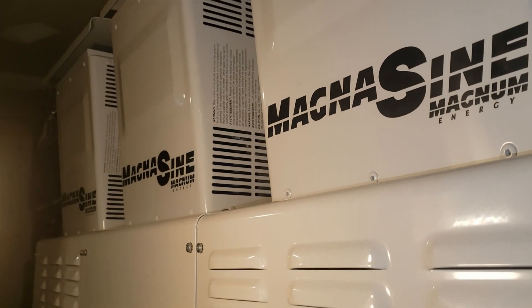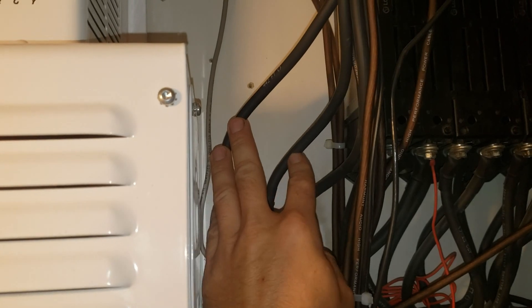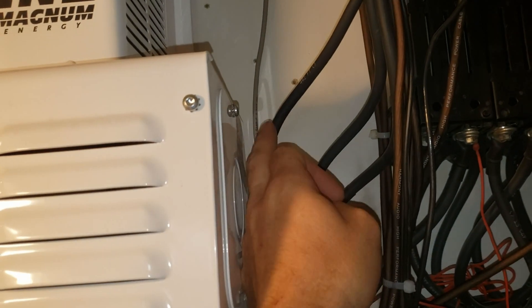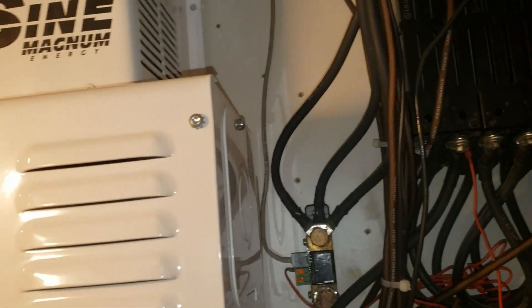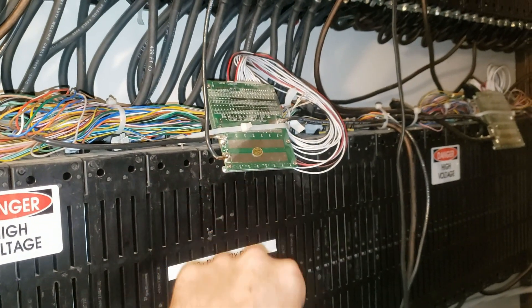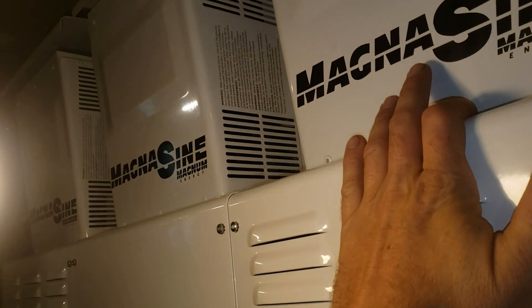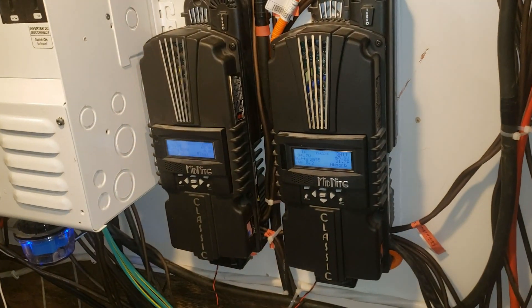So we're about to do a heavy draw test here. The only thing — this is my weak point — I still only have three six-gauge wires right here. So at full power these will be putting out 75 amps each approximately, which is a little bit too much for them. I'm gonna put another two wires on here — that'll be plenty. On the DC side I have a million wires — each one of these wires is coming from its own little bank of batteries with little BMS units rated for 35 amps each. I was worried that I now have too much inverter power for how much BMS capability I have, but I just did the math — I have 535 amps worth of BMS, so that shouldn't be a problem.